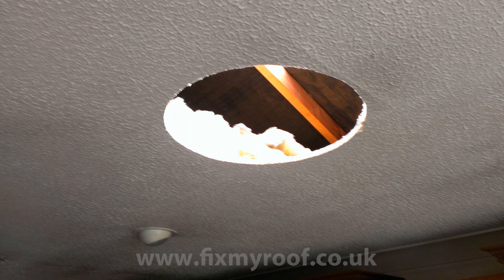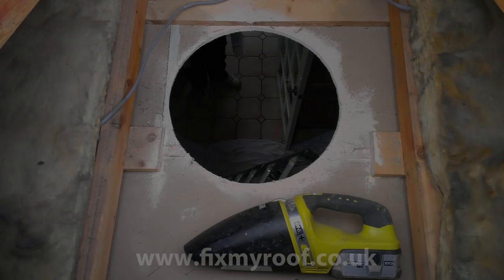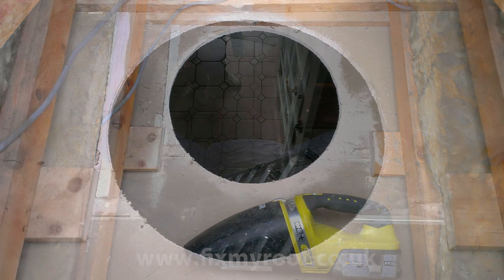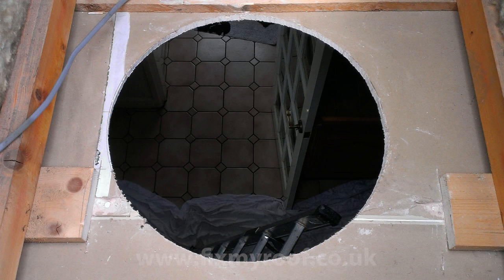Hopefully whilst cutting, most of the dust will rise into the loft, but always wear a mask when doing this. Now if we go back outside or into the loft space we can clean the dust off, and this is an important step as later we will be bonding tape to the ceiling to stop dirt, dust and insects getting into the sun tunnel. Try and make the ceiling above as dirt and dust free as possible.